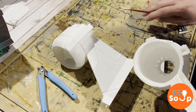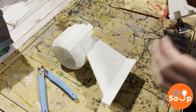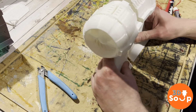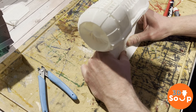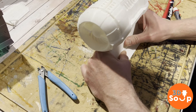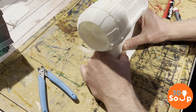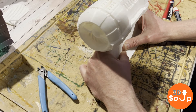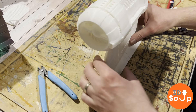I've applied the epoxy to the front and I'm also applying it to the back. With epoxy resin it's always good to apply it to both contacting sides. Once we've done that I'm going to line it up and make sure we get it straight. Got a bit of time to work so get it right, get all the seams lined up. Two or three seconds now is going to save you a couple of hours later trying to sand it down and get it right.